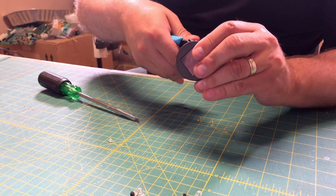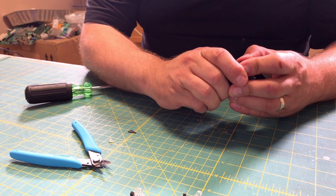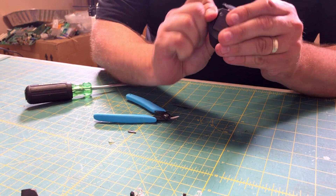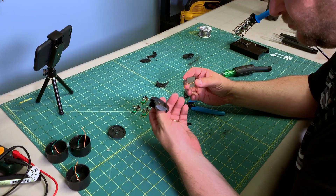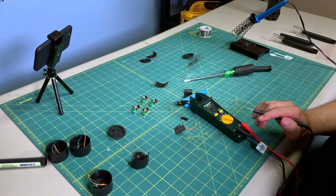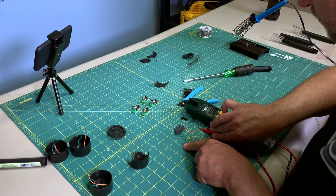Next I need to get the solar panel off of the cap, and to do that I'm just going to chip away with a pair of side cutters and remove the excess plastic. There's a double-sided sticky tape that holds it onto the cap, so I just need to get under there and then eventually pry it up and pull the wires through. A little hot glue was also holding the wires in place — and there's the sticky pad and our little solar panel is exposed. Checking once more confirms I'm getting between one and one and a half volts depending on how much light is hitting the panel.